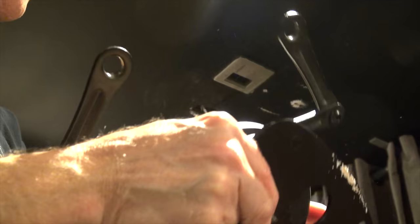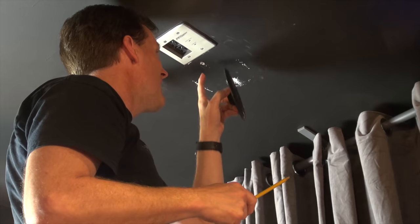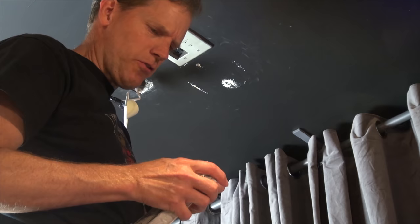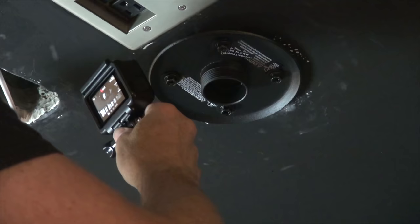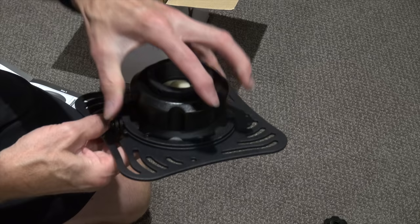Goodbye, Sony. Okay, that marks the screw holes. I'm going to drill a pilot hole there and mount this plate right up on the ceiling. And I'm going to fill in the old holes with some soundproof putty — I'm using duct seal putty to fill in the holes. It never hardens, stays flexible, so it's really good for sound. Four bolts in place with washers — time to attach the plate.